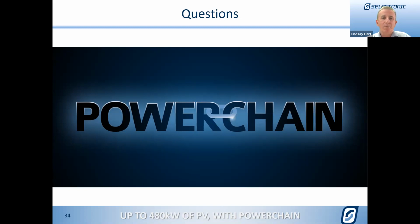So the difference between a supported battery and a managed battery: a managed battery has communications, the CAN bus between the battery and inverter, such as BYD's LG Chems, where settings are dynamically changed as the battery makes those decisions, whereas a supported battery is one that doesn't have that communications, but Selectronic and the battery supplier, such as Gen Z, for instance, is an example that we've got there now, where it's like a lead acid battery, if you like. It's a static sort of settings, but those settings have been worked out and agreed to between both parties, and we'll also be able to then say what the minimum number of batteries are that you need.